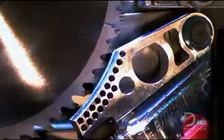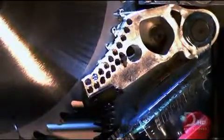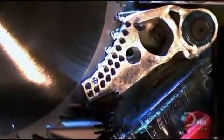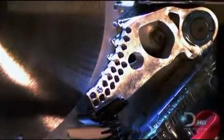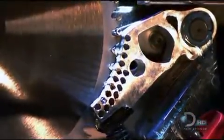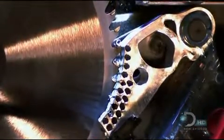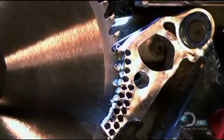5,000 RPMs is a lot of energy. The energy has to go somewhere when it stops, so it's transferred to the Sawstop module, which acts like the crumple zone in a car. The module and saw blade are now officially trashed. But hey, at a cost of about $60, better to pay that than with a finger. It's an amazing idea, and it's implemented in a way where you're using energy for its own stop.